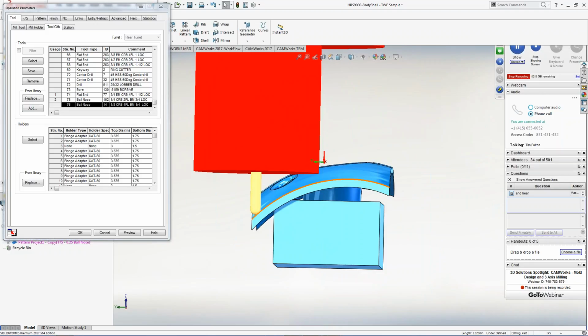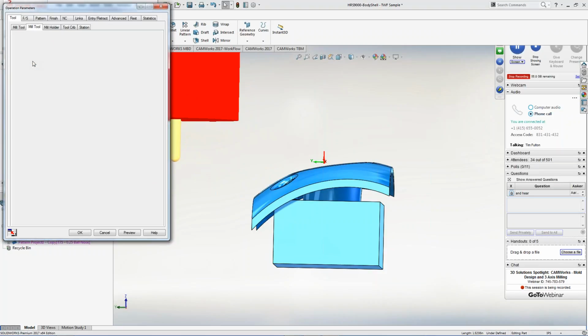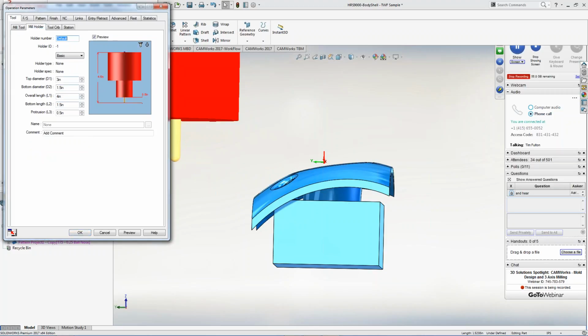So really what it is, is the protrusion length that's inside. As I said, this is where the detailing comes into play. I still want to use the same tool, 4 flute, with the right length of cut. So I'm going to select that, and then on this window, I actually have my protrusion set here. How much do I actually want to push out? So I have the overall length, the flute length, and the protrusion right here, and I can start adjusting it to what I need.